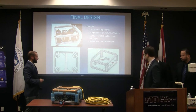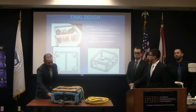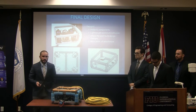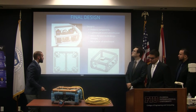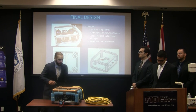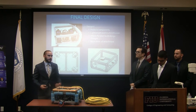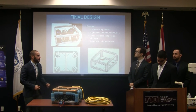For our final design, we went with a box-like structure that protects all main components, thrusters, and canisters where our programming is. We use lightweight extrusion aluminum with holes running through the inside to keep it as light as possible — each corner has a hole in it. Our thrusters use vector thrusting, providing maximum moment to the center of mass of the robot for easier maneuverability. When going forward, the two side vectors cancel out so you go straight, and turning is also much easier.